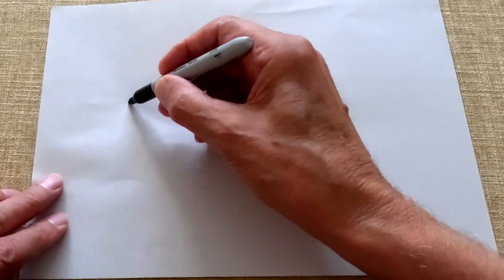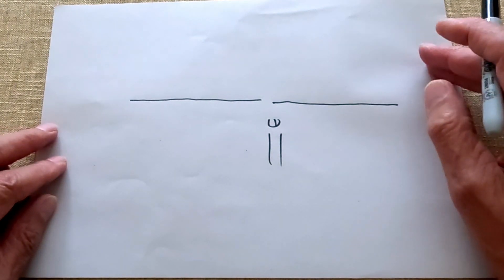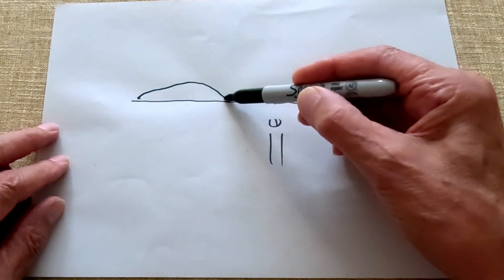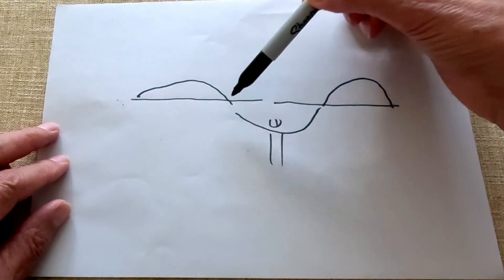There's a trick you can do to bring that resonant point down, and it effectively uses a capacity hat — a bit of capacity wire — which is simply a length of wire. Let me draw this on paper. Here's how you normally use this trick to bring the resonance of the 40-meter dipole on 21 MHz down to within the band. Here's a 40-meter dipole, fed at the center with its cable. If we operate it on 21 MHz, we get a waveform like this.